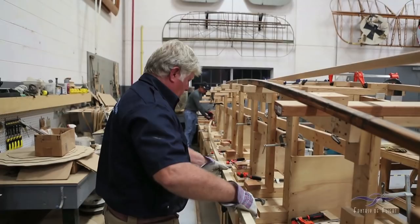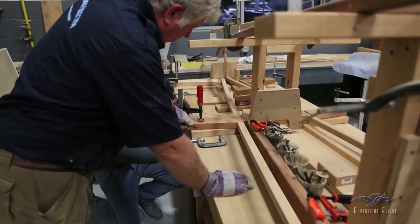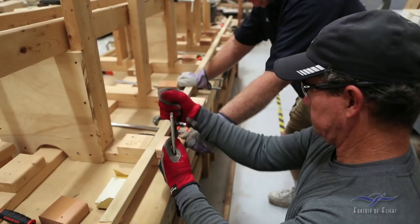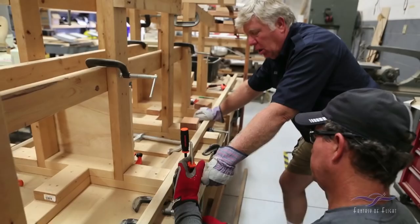The T is just a mark I made on the longeron before it goes into the jig to make sure that the splice that we've made faces a certain direction. The splice needs to face in a certain direction just so that the force is not pulling on the joint itself — kind of pulling across the joint. I steamed this one an hour longer than I did the other side and I think it bent better.